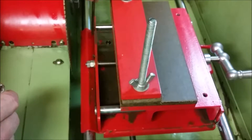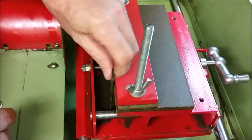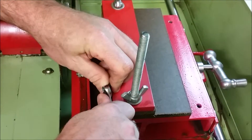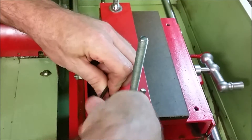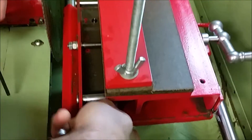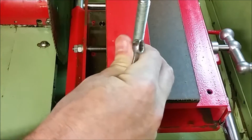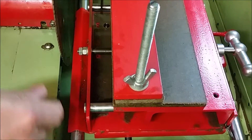These two adjusting screws for the lower rollers, front and back, provide an easy way to adjust that. As I run that set screw down, that is pushing the roller up. On this one here, I'm going to feel when my roller starts engaging — and I've got that one.